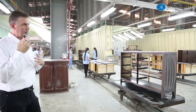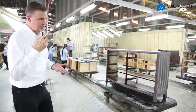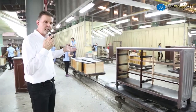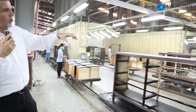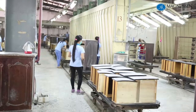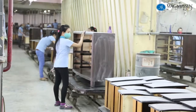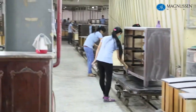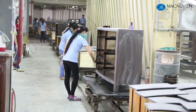Multiple steps involved in the finishing process require many layers of sealer to lock in the previous process. After each application of sealer, it goes through a small drying period of about two hours, but it's continuously running through the finish line. Each time, it goes through a sanding process. You can see they're taking the time to sand the sealer surface smooth. They do this to ensure that as it goes to the next stage, you have a flat, smooth surface, which allows you to finish the product properly and give the character and depth to this finish.